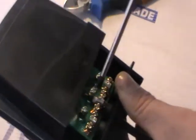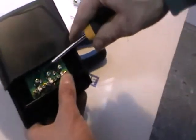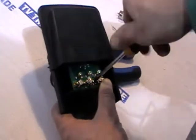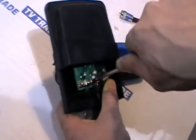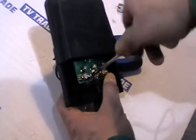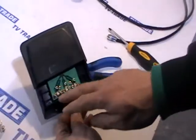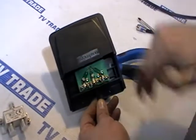What we are making sure is that the core wire here is being firmly locked into position. You can see that core wire there, and then the earth wire on the outside we simply lock into position — locking it left and right. Then we can pull the cable at the bottom and see it is locked in position. We just repeat the process with cables running from the other two televisions, running a cable in here and here.